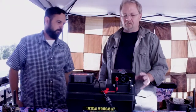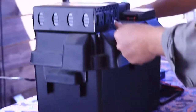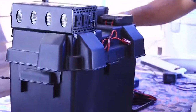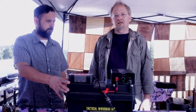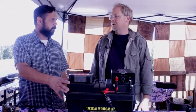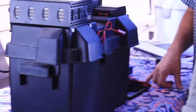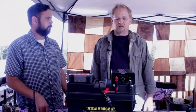So the capabilities — it's got several outputs. The main output is the inverter. It's got two 115-volt AC outputs, and you switch it into the up position on the connector there. It'll give you a modified sine wave at 800 watts average, and then it'll peak out to 1600 watts for a short amount of time. That's useful for getting a compressor motor started on a refrigerator, or a skill saw or something like that. You've got to stay within the 800 watts of average power, and you've got to stay within 1600 watts of that startup surge.